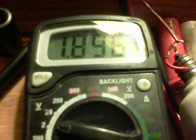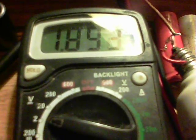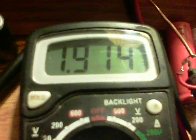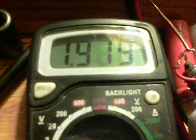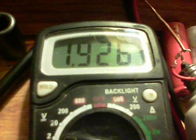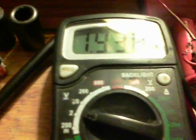1.926 — and it's coming back down again. What I've noticed with charging a fair few that used to be sulfated, NICADs and NIMHs — everything's worked, which has been really surprising. The voltage will climb and then go back down again, maybe a little related to the SSG where you might see the voltage go right up and then come back down. We're now at 1.933. That's about 15 to 20 seconds.